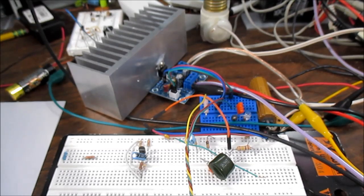Of course, you have speaker wire. You know, if you have, say, 0.3 ohms of resistance in that speaker wire, that's pretty significant. The speaker wire alone, let's say 8 divided by 0.3, that knocks your damping factor down to 26.6. So even if your amplifier did have a damping factor of 1000, that speaker wire alone just killed that.